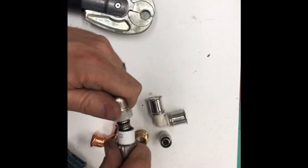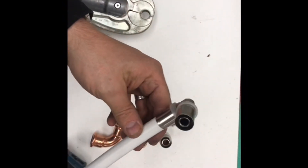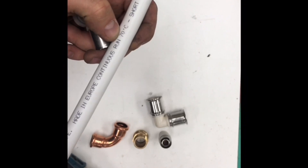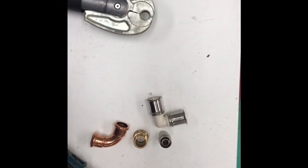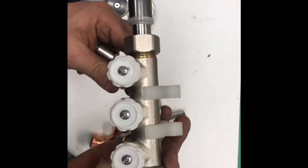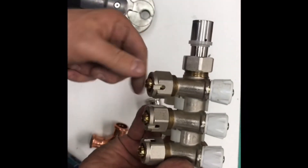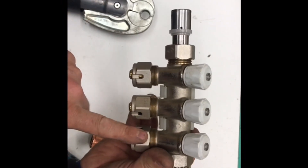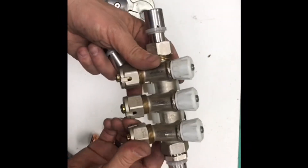It's very efficient, very quick, clean and tidy. This stuff is memory stable — wherever you put it, it'll remember it; it doesn't sag like plastic. It's suitable for secondary returns and continuous use at 70 degrees — some plastic pipes aren't. There's no plastic pipe on the market you can run secondary water through all the time. The other great thing is you can have point-to-point plumbing using a domestic sanitary manifold. Your supply comes in, you cap it off or carry on running, then take each feed out — dishwasher, washing machine, fridge — with a separate manifold for hot. Really efficient, fewer fittings, less mess.